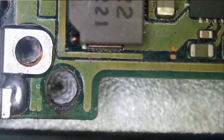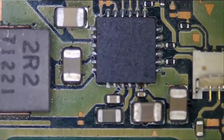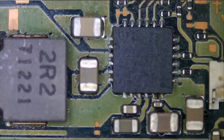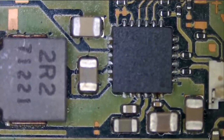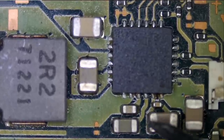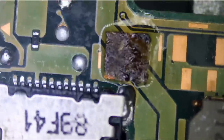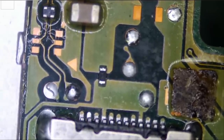Let's take a look at the board to see what's going on. This is one of the boards they mailed over — I'm going to start from the far right. It doesn't look like the BQ chip was changed on this board. Let's quickly test and see if we see anything obvious — meter in diode mode, just randomly testing some caps here. No issues. We're going to quickly test this component for continuity.